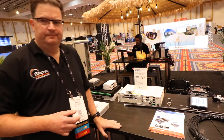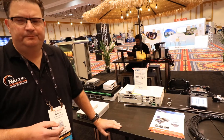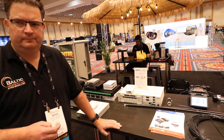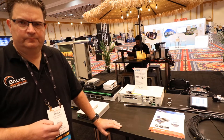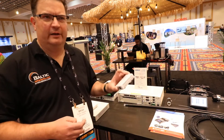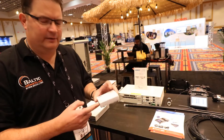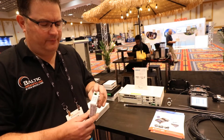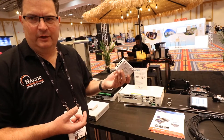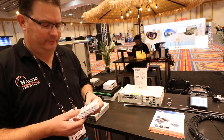I have a different vendor, different manufacturer, and their little box ONT doesn't have a POTS port on it, so that would be nice. Yeah, that's what makes this product unique. A lot of these at this size just have gigabit ethernet out — fiber in, no POTS — but this gives you that single telephone line for POTS.